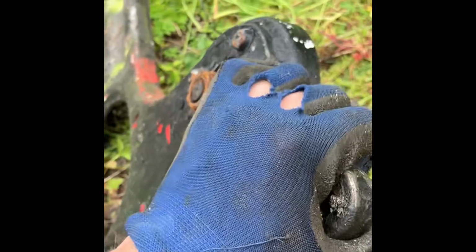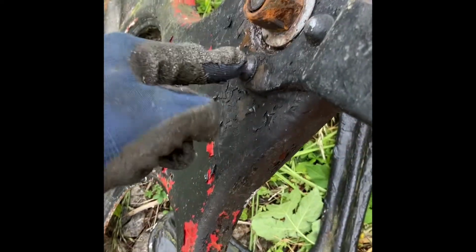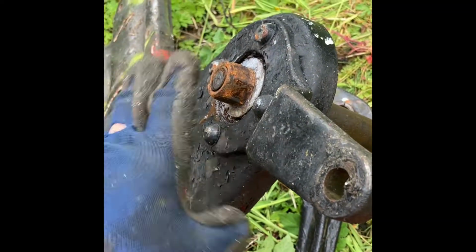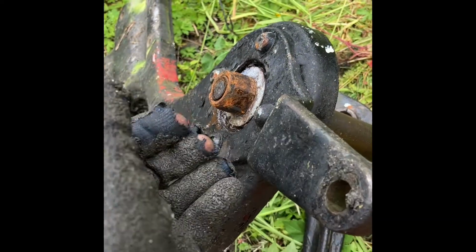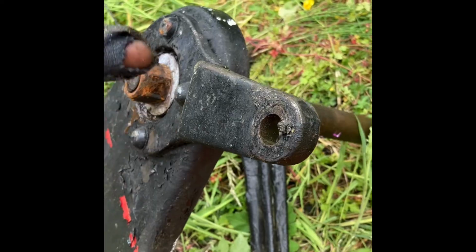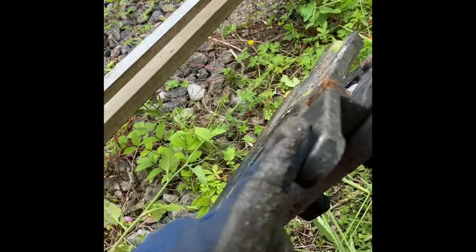You can see what I mentioned about the tennis bat, as we call it, or the frying pan, however you want to call it. This one's riveted. The other one you can take off. The riveted ones will be in the right position from the factory. The ones you can take off, someone may have messed around with it and put it in the wrong position. So make sure it's at, as you're facing it, 1 o'clock, or if you're behind it, 11 o'clock positions.